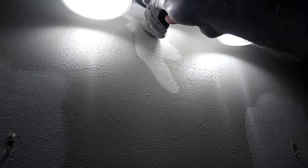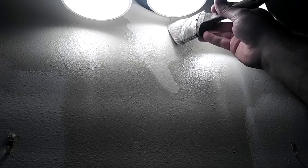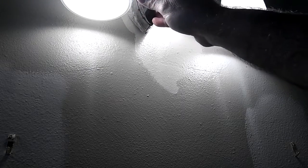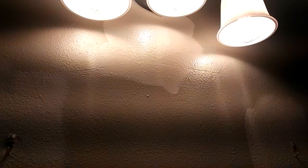I'm not worried about getting paint on the fixtures. People get freaked out - 'Oh, I've got to take down the lights!' I'm like, who's paying for that time? The other thing is one guy says we need a really stiff brush to paint. You know what? There's something called water. If your paint's too thick, you just put a little handful of water down into your paint - you're not watering it down, you're just getting it to be more workable. Stir it up and now your paint's thinner and you can use the same brush. You're not going back to the truck trying to get a different brush.